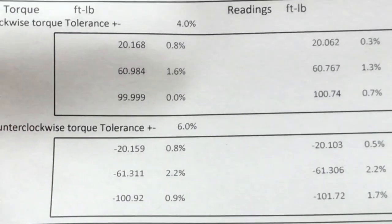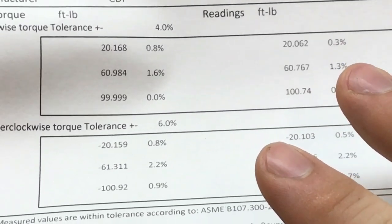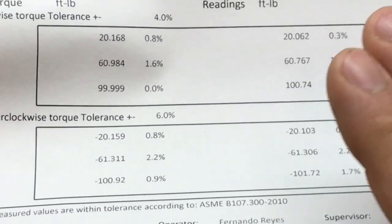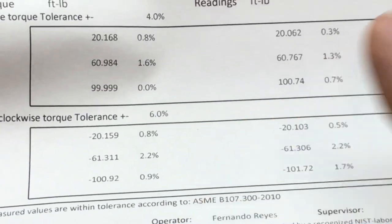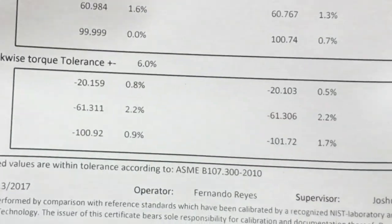because any reading I've done on torque wrenches has pretty much explained that you don't typically want to use a torque wrench to its limits. So if your torque wrench is rated at 10 to 100, you don't really want to trust the reading at 100, and you don't want to trust it at 10. You'll be close, but it won't be exact. But this one seems pretty good.